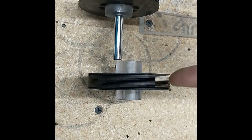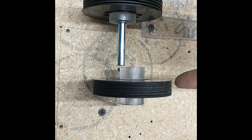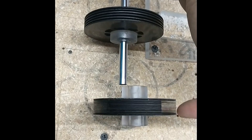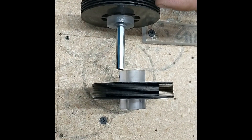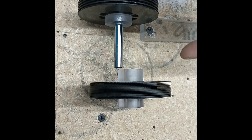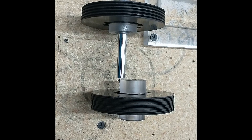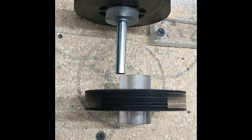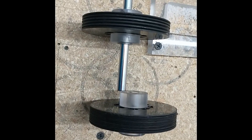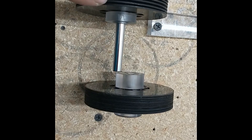The surface area in this is many times greater, but the biggest impact is how close the discs are together. When you decrease the distance between the discs by half, you increase the viscosity between the discs by four times, I believe. So we will get much more torque out of this rotor.